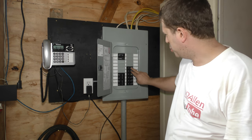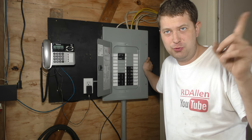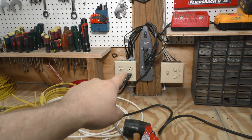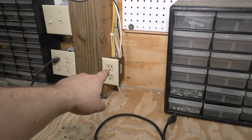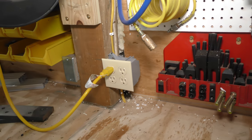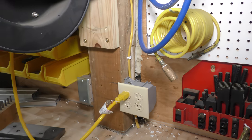Okay everyone, that's going to do it for this video. We've got two new breakers — so this wall here is the first breaker, then we've got the second breaker and the third breaker. Everything went pretty good. We also got a new plug in for the TV. We disconnected the wire from the plug that feeds the next one — that is now being fed by the new breaker. Disconnected the wire feeding from plug to plug, and added a new wire up to the TV. The last new breaker feeds this plug as well as a couple of plugs underneath the bench. If you have any comments or questions, be sure to leave them below — and as always, thanks for watching and until next time.